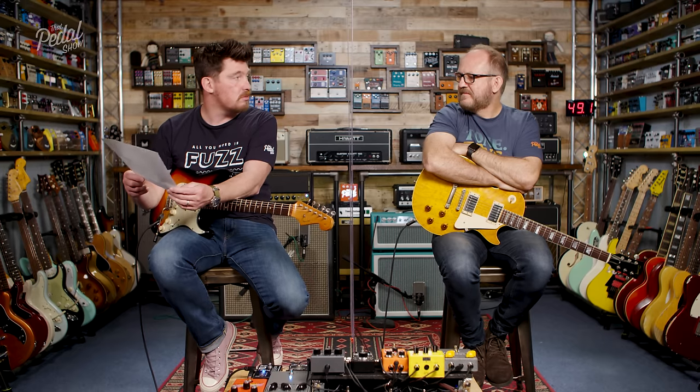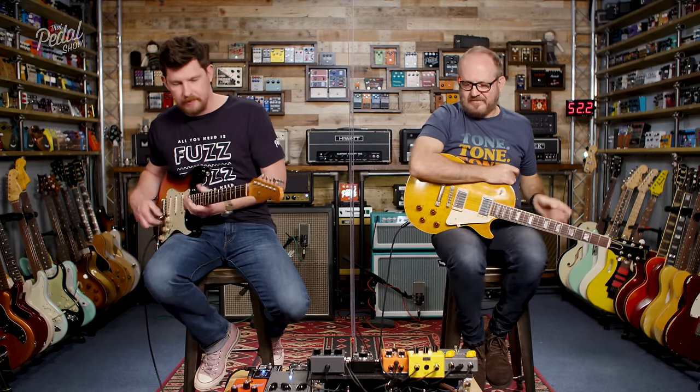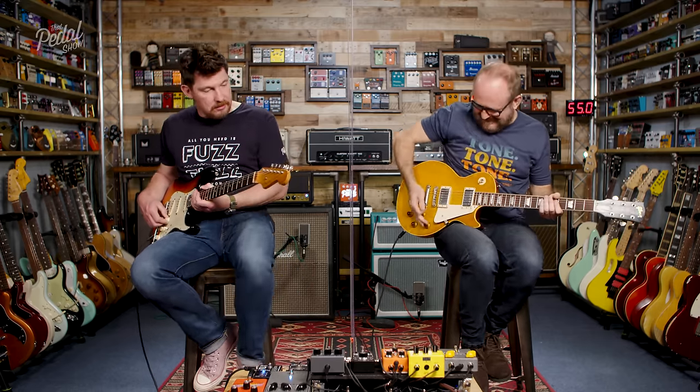So he does a pedal called the 108 Sound, which, as the name implies, uses BC-108 silicon transistors, I guess to sound a little bit like a Mark I Tone Bender, but with a bit more gain, which seems to be a theme. The Black Hat one is a special edition using special transistors based on that. I had to write it down because I'll never remember: TO-106 Black Hat transistors, NOS from the 1970s. So it's based around a Mark I type tone with a bit more. Come on then, Dan, you were rocking out, so continue. Okay.